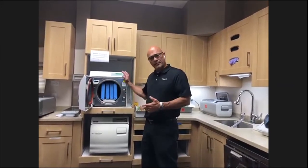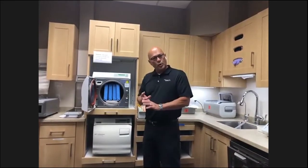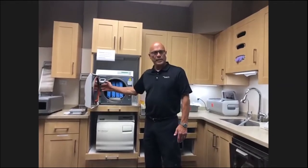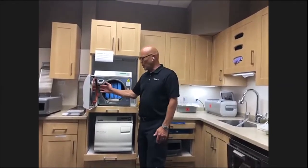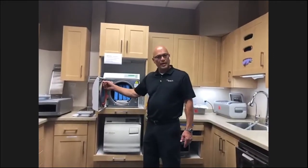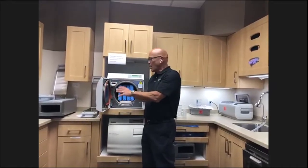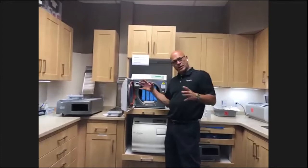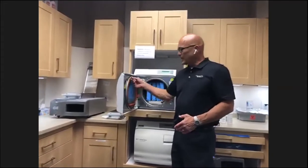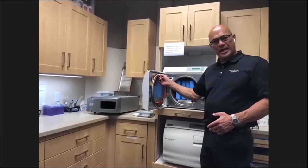There is a manufacturer's maintenance program, daily, weekly, quarterly, but that's definitely the most important, is to drain the reservoir weekly and refill it with distilled water. Your door gasket, very easy to tell the age of the gaskets. The door gaskets, when you first put them in, are very tight and very snug. As they get older, they shrink. The way you want to test them is when the door is cool, wiggle it around. The older it is, the looser it is. And that tells you the age of it.